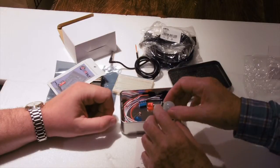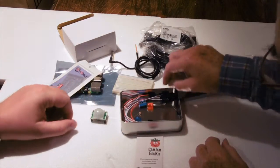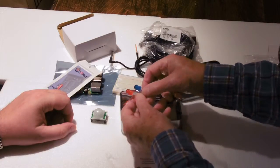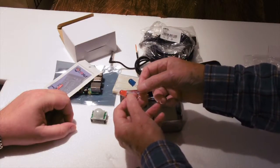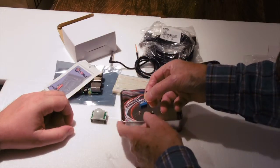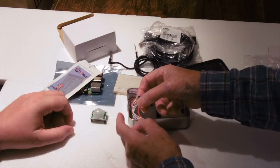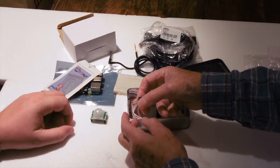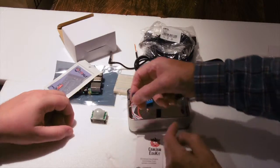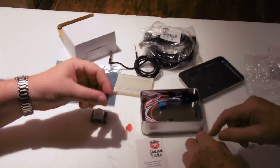Then we've got two different colored LEDs — a red LED and a blue LED. The worksheets explain that the lengths of the leads are two different lengths, and these things have to be connected in the right polarity. The positive goes to the long lead and the negative direction goes to the shorter lead. We'll see that more when we connect things up, but it's important to get that the right way around.